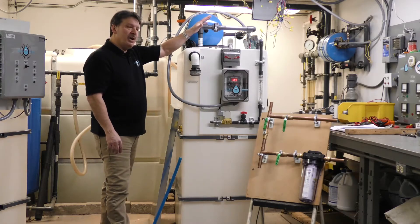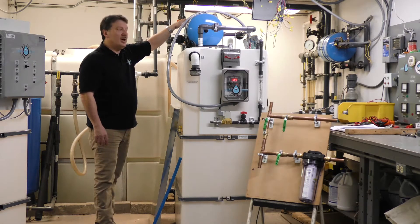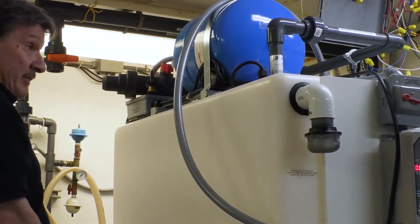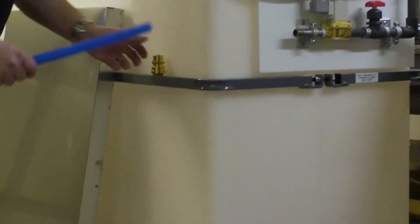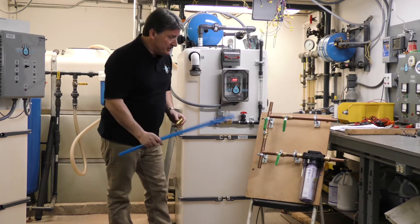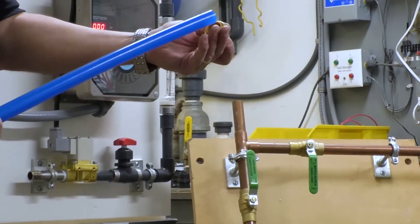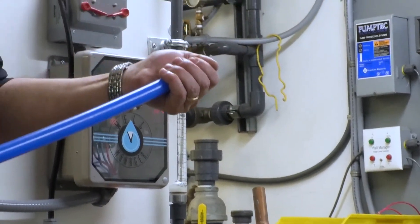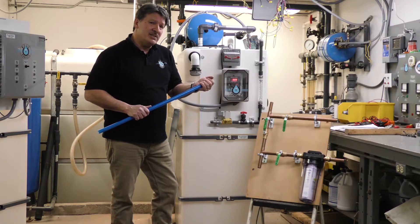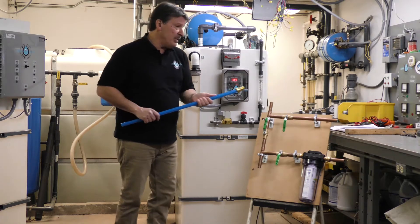Water is delivered to the home through the consistent pressure module, out through the one-inch pipe on the back of the unit with a union fitting that allows the system to be disconnected at the back if needed. Not difficult to install. One of the things I really like is PEX tubing — this happens to be three-quarter-inch PEX tubing, very similar to copper tubing in size and volume. You use that combined with very simple SharkBite fittings — no soldering, no difficulty in getting these leak-free. I do a lot of that now and really like using PEX tubing.